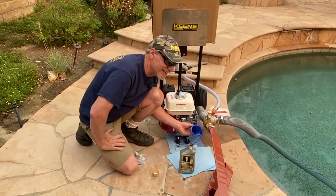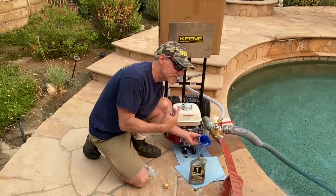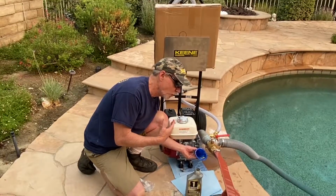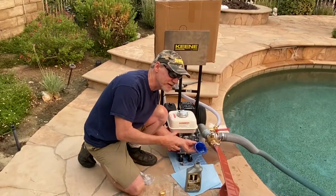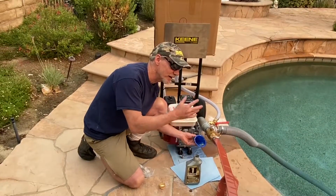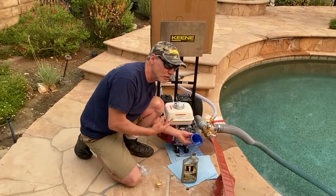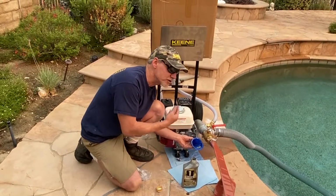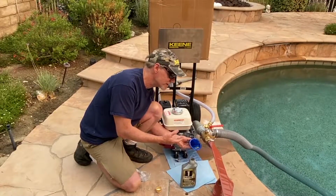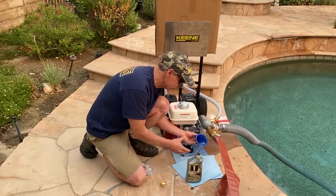Well, you know, a lot of guys don't really understand that if you want the system to live, there's procedures, and if you don't pay attention to the procedures, which I'll get into, this thing will be gone in two to 3 years. Yeah. A lot of guys are going out buying these Chinese motors and pumps and the import stuff. It doesn't hold up. Because if you don't have certain things that you add into the pump, like a drain petcock, and you don't follow the proper steps, then you're going to fry your pump in no time.